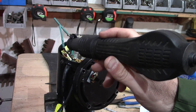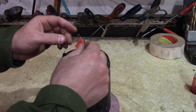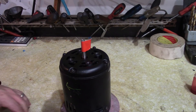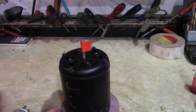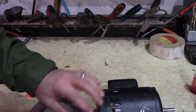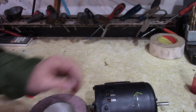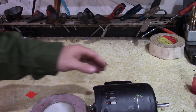The wires were kind of tied back with wire ties. I had an arrow on here marked in yellow so you could see it — it was turning this way before, but after reversing those windings, here you go — it's spinning the other way now. The only concern I have is that it's a little louder than it was. I think it's just the way I put it back together; maybe something in the housing isn't quite set right. I can see there's a loose screw here. I think this motor's gonna work, but I'm probably going to pull it off and put it back together to make sure it sounds a little quieter.